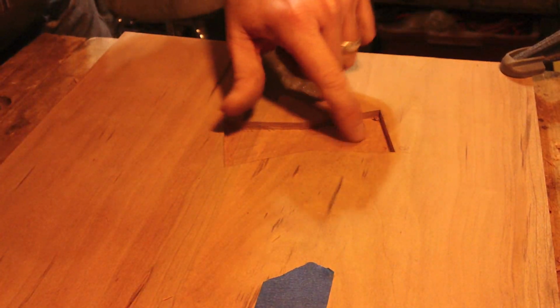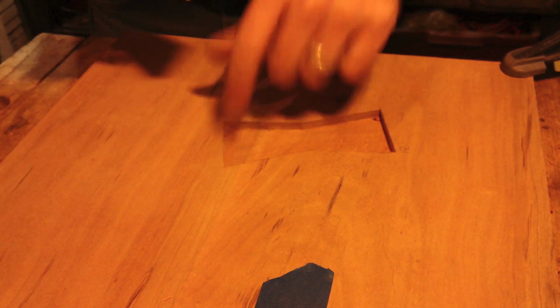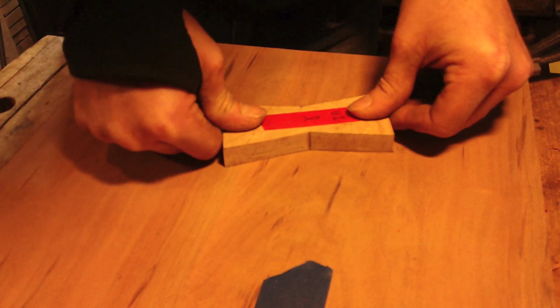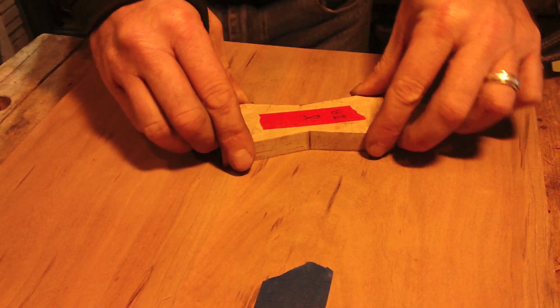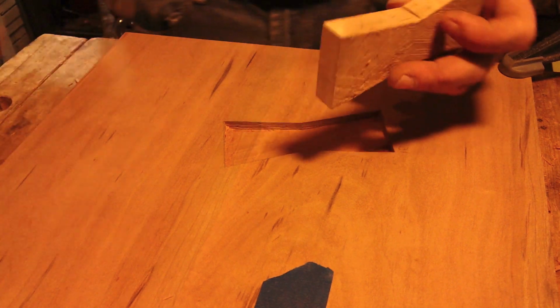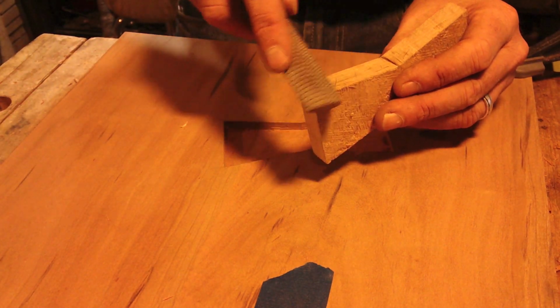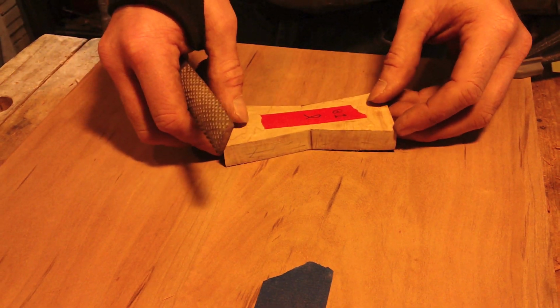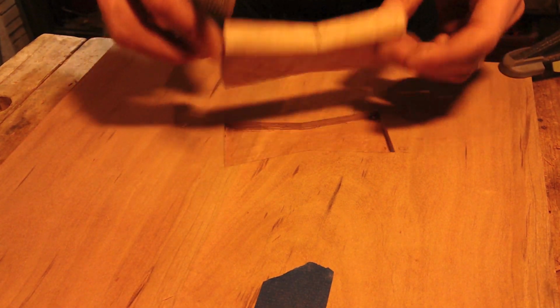and I'm down enough, and I've got a flat bottom. I excavated another dowel. I love it when I do that. You can look at your glue work then. It's almost there. Okay. So now I'm going to take the rasp, and I'm going to relieve just the edge, get a bit of a bevel to where I can get it started, and get her down in there.